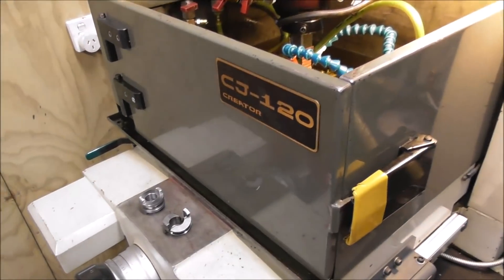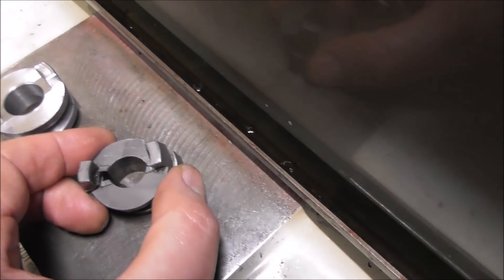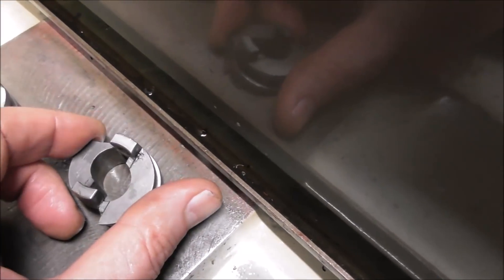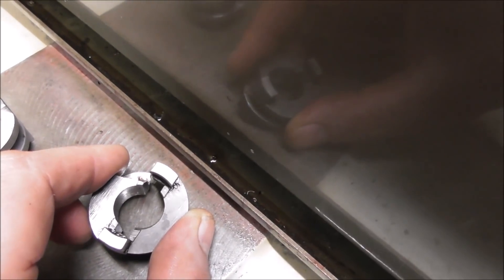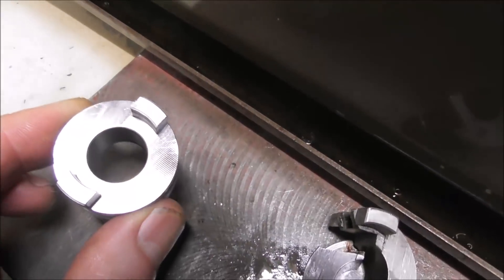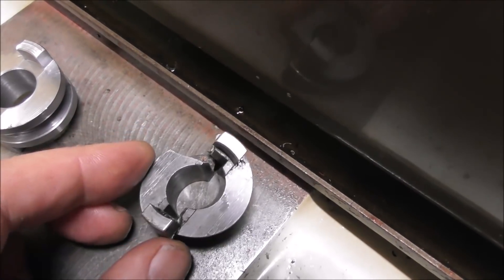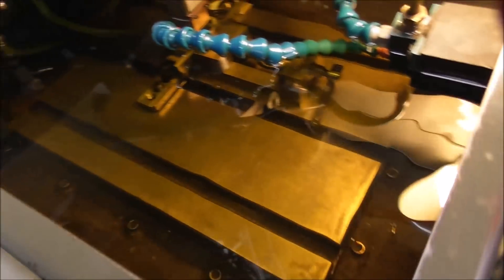This is an interesting little machining job. This sliding coupling, or double-keyed dog clutch, broke in a machine crash and I'm making up replacement sliding couplings. You can see there's a double keyway cut in there internally. I made up the basic blanks — it's a sliding dog clutch or double-lugged coupling, out of case hardening steel called Super Impacto. I'm going to machine it all up and then get it case hardened — it's an ideal job for the spark eroder.